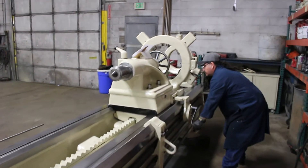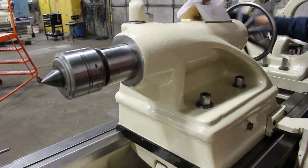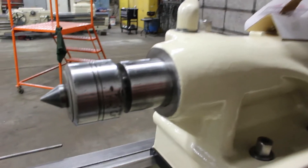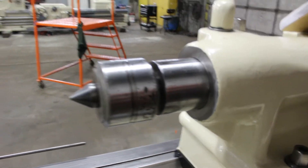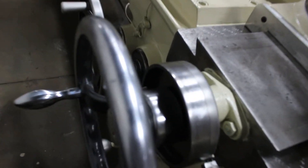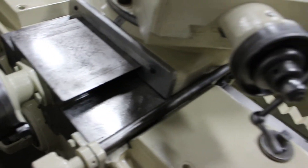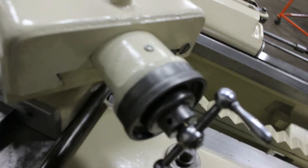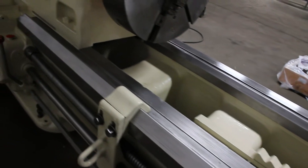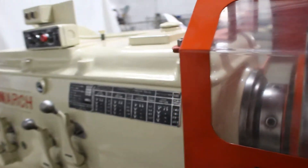Frank's pointing out this extra heavy-duty, massively wide, rigid number six Morse taper tailstock. It has beautiful etchings on the quill. One thing I'd like to point out is the satin chrome finish on these handles. Taking a quick look at the cross slide and getting into these bedways — very well maintained machine. Extra wide saddle, extra wide bedways, massively built headstock.